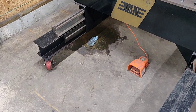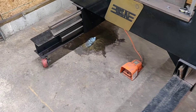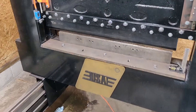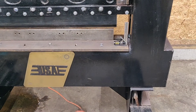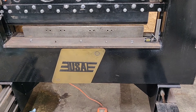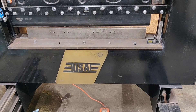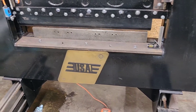The base for it is just on these little beams with casters — it moves around, though it's definitely heavy. The main structure is a 12-inch beam inside, and it's got 3-by-8 by 5/16-inch wall tubing vertically placed within the beam itself all the way across on both sides and welded in. It's extremely solid.